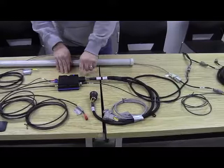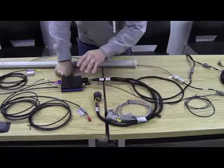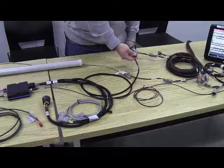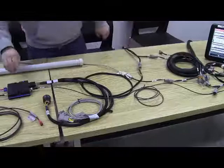On the other side of the CL55 there are two wires. The large plug is used to connect to power. There are three plugs that are not used: an RS-232 plug, a Deutsch plug, and a CAN diagnostics plug — these can all be tied up. The only plug in this harness we're using is for power, which is a three-pin Deutsch plug that T's into the monitor harness. You'll get a little T-plug that ties into the power from your monitor's power supply — one T goes to the CL55 harness and the other goes to your monitor harness.